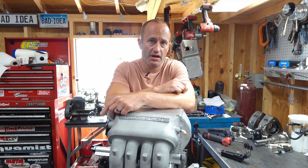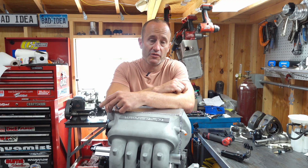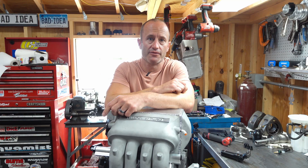I'm really stoked how this came out. Even considering the assembly effort, this was much less work than attempting the same geometry with traditional fabrication techniques. I still have yet to powder coat the intake — normally I would do a black wrinkle with exposed aluminum on the raised text for most actual BMW parts, but I might consider alternatives for better aesthetics in the small engine bay. Drop a line in the comments if you have any ideas. If I had to do mine again, I would perhaps extend the velocity stacks out a little bit further to gain some more runner length and make it easier for support removal.